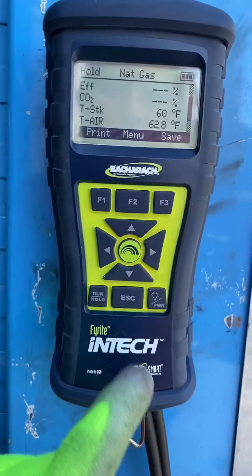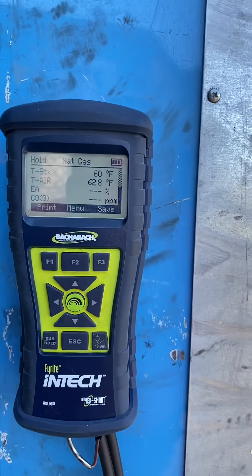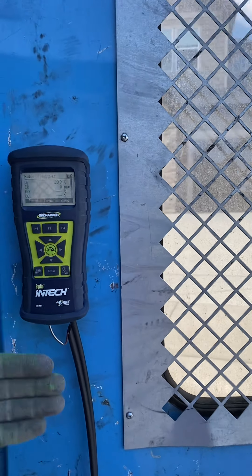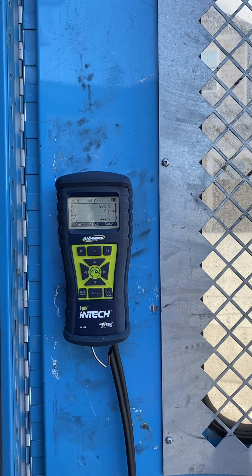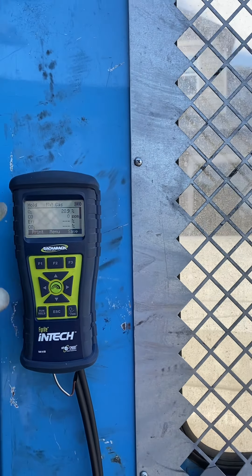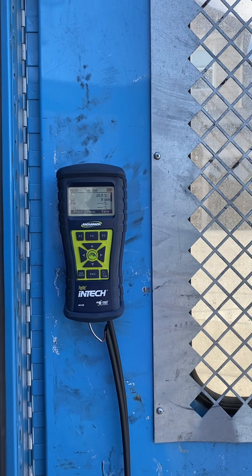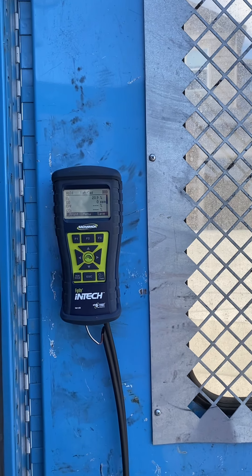We scroll down and we should have the CO2. This one actually has a second sensor — the top one is really designed for combustion analyzing on the system, while this one is for doing in-house readings. Normally we're technically supposed to have 21% oxygen, but I have never gotten that reading due to all the pollution in the air. But these should all be zero — there shouldn't be anything. Show the homeowner this prior to entering, that we do have good working equipment.